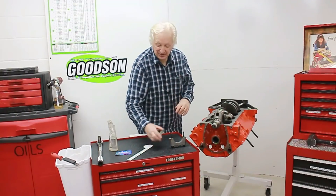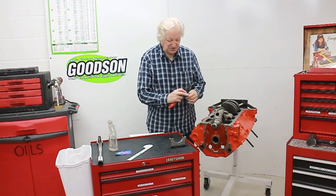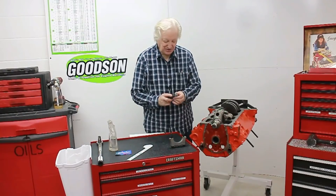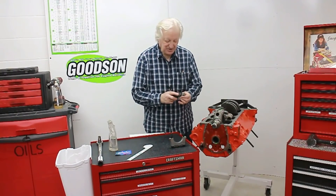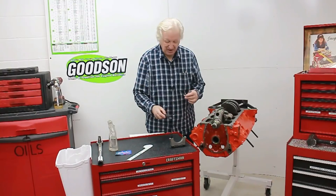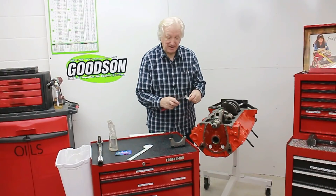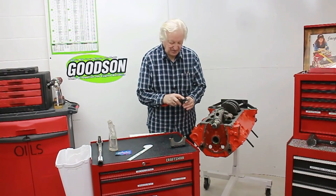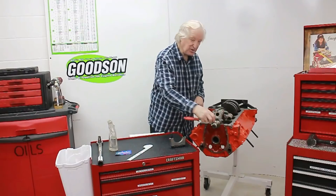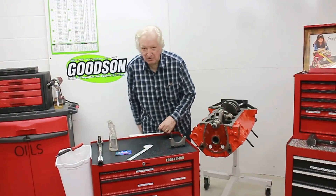Before you install any of the bearings, take a look at the back of a bearing and you'll see there's letters stamped on it. Quite often these letters are raised, so I very carefully take the raised lettering off. To stop grains of steel from the bearing going everywhere, use a fine file and put a couple of powerful magnets on the back of it. All the grit, and should you find you have to file these notches, will stick to the file — it won't drop off anywhere else. When you put the file down, hold it over a trash can.